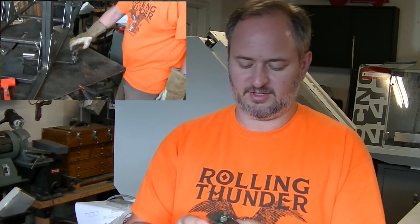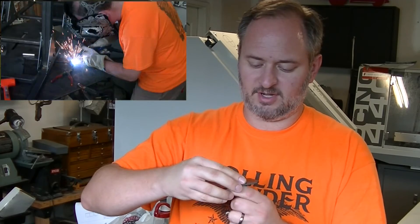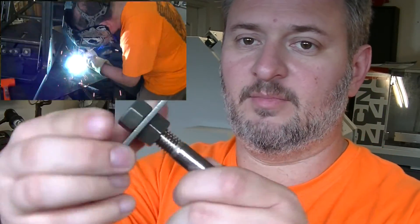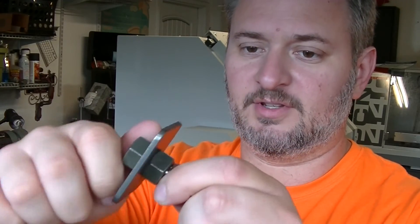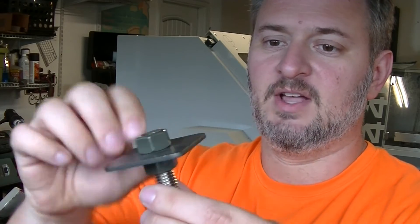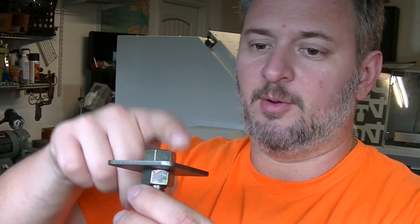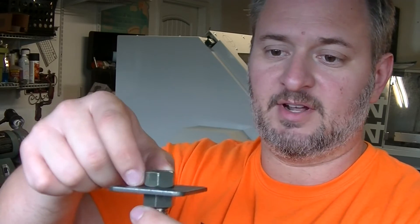What I've got is stainless steel hardware and a nut. What we do to get this set up right and make sure that everything is lined up the way we want — it's pretty straightforward. Effectively, what we do is we go ahead and butt it up tight. I'll actually torque this down a little bit so it's good and tight, and then I will weld this nut to this plate. I'll probably only weld three positions — just enough to hold it.